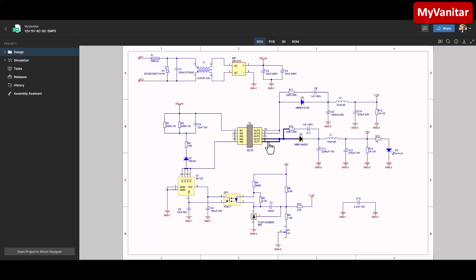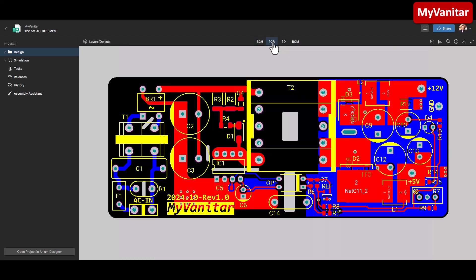The secondary of the transformer has one winding going to each set of Schottky diodes. These RC snubber components dampen the rectification spikes of the Schottky diodes. Here is an LC filter to reduce noise, and an LED to indicate output voltage. The last components are two dummy loads to push a basic load at the output to stabilize it — 12V divided by 1k resistor draws a low current, which is sufficient.